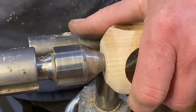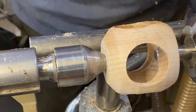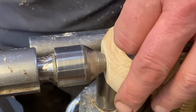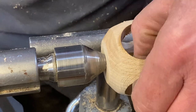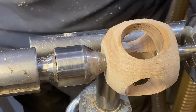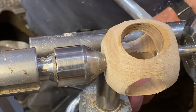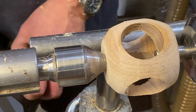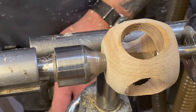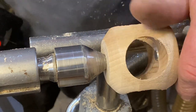Because that is just scraping. And one woodturner I always like to watch is Jimmy Clewes. I think it's fantastic. And he had it right off when he turned around and said, the difference between scraping and cutting is you could walk out in that street, get anyone walking past, come in here, mate. Hold that like that and just go around there like that. And they do it. But you get someone to come in and you say, right, angle that over, ride that bevel and get a nice smooth cut. That's the difference.